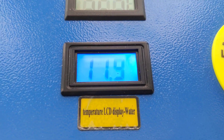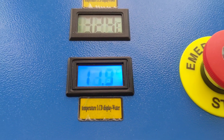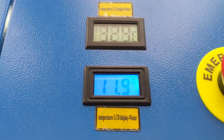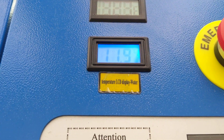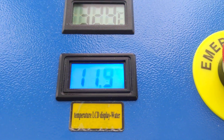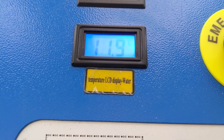When I started the laser up, it was probably about 22°C ambient. Now see we've dropped down to around 11°C. You can see that it definitely has chilled it and has maintained temperature while performing some pretty busy operations.